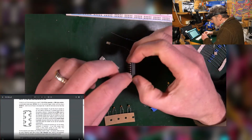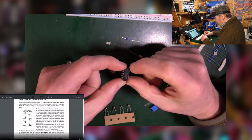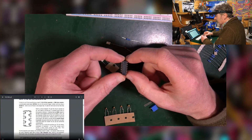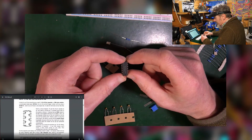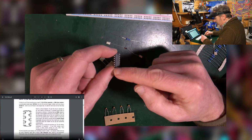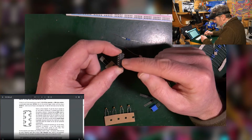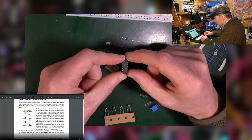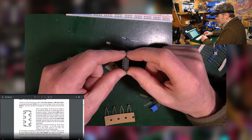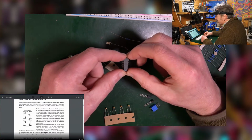Now, we're talking about this fella here. And chips or ICs have an orientation. They have a cutout which tends to show you where pin 1 is. So if we're looking at the manual where it's got the drawing of it, apparently you've got a positive voltage on that front leg. You've got a ground on that bottom left leg. And in between you've got 6 Schmitt triggers which go just in pairs of legs, which is beautiful. What a lovely thing. I mean, chips are always a mysterious entity. It's just this slab of stuff that contains unknown functionality.